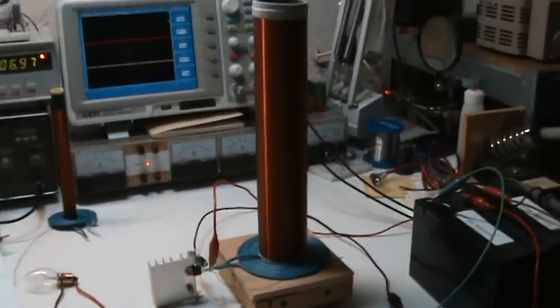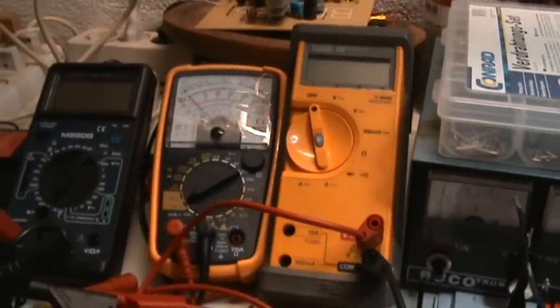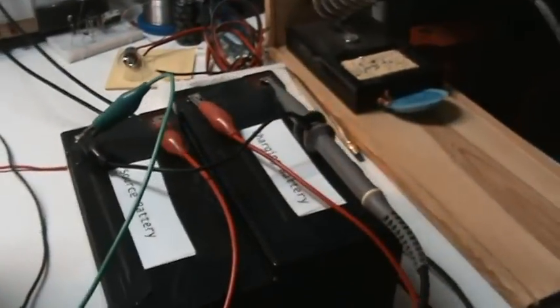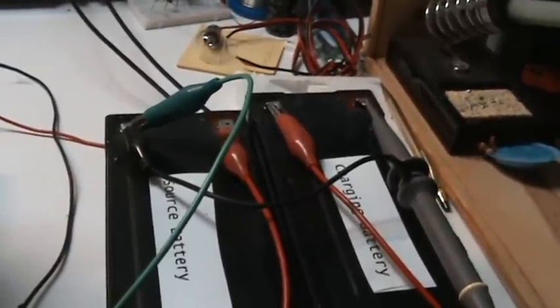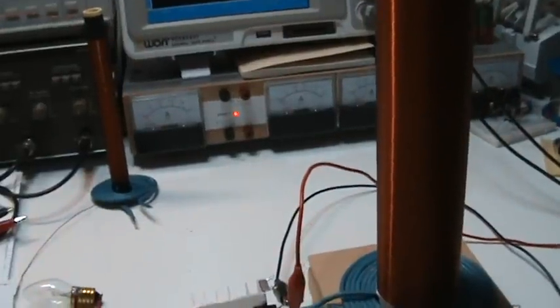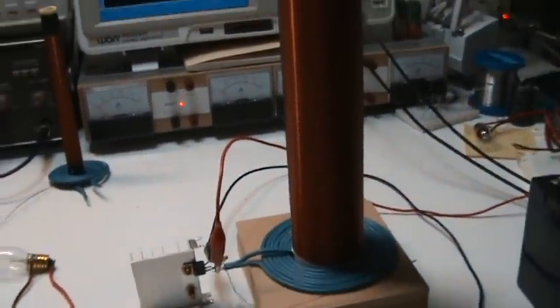I was trying to measure the input, but my multimeters stopped working. They dimmed and went all over the place. So I now hooked up my yellow probe across the plus and the minus, the 25 volts, and I have the red probe hooked up in the return line across a 1 ohm resistor for measuring the current returning. So that's what I want to do first, set a baseline input to see what's going on in this circuit.